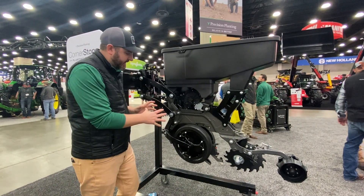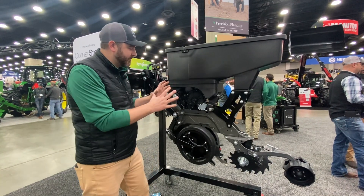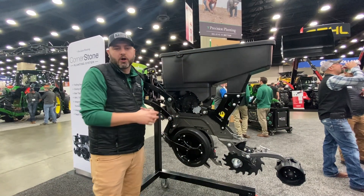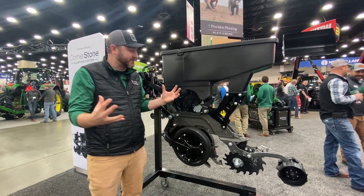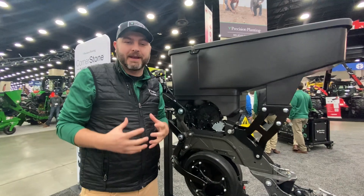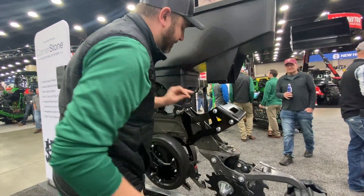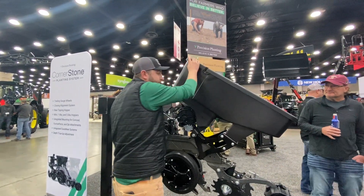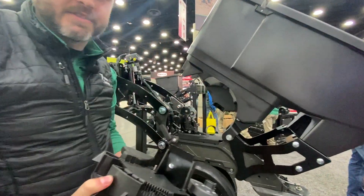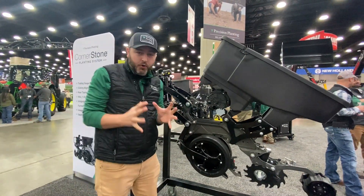When we talk about ease of use, one thing I think about is when you look at a three-bushel hopper filled all the way to the top and something goes wrong on that row unit — you'd have to lift it, dump it out, and try to manage it off the planter just to get inside. We determined there's an easier way: a rear-tipping hopper. You lift up the hopper and now, even when it's full, you have access to the entire inside, so you can pull off your meter and easily get in to diagnose or make adjustments in the field.